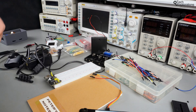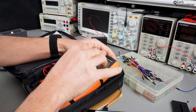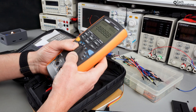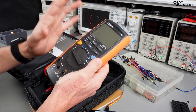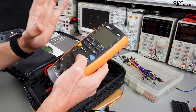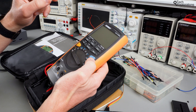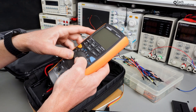Still talking about tools — I want to show you a multimeter. I highly recommend that you have a multimeter in your kit. If there's only one bench instrument you have for this course, it should be the multimeter. The one I'm showing here is an auto-ranging multimeter. I've got a dedicated lecture about multimeters, but a multimeter is the instrument you'll be using the most in this course to make measurements — measuring voltage, resistance, current, and capacitance. A simple multimeter is all you really need; it doesn't even need to be auto-ranging.